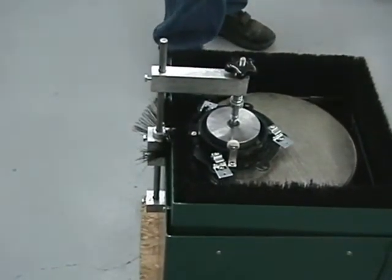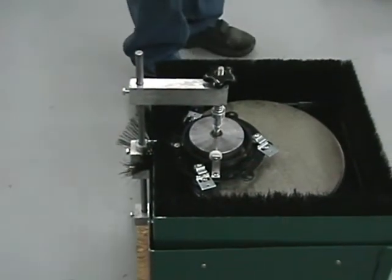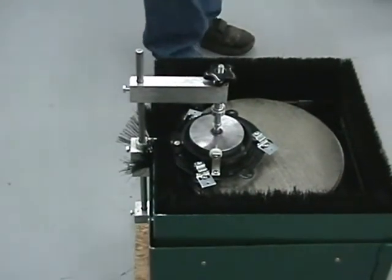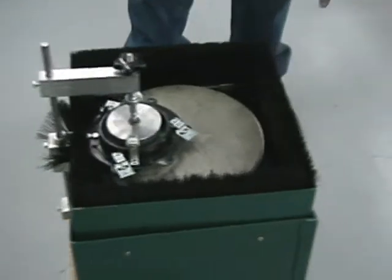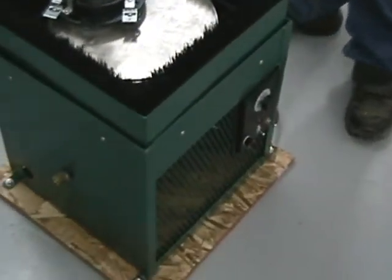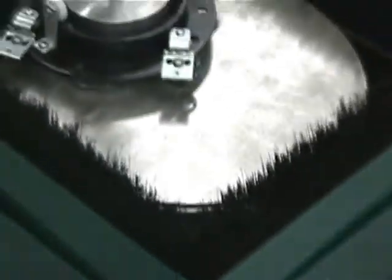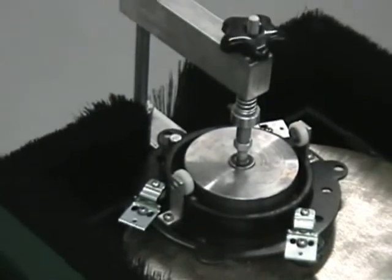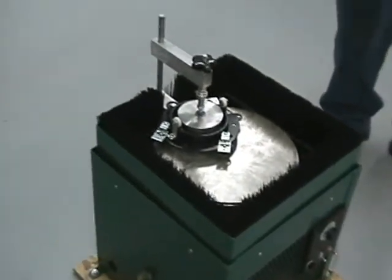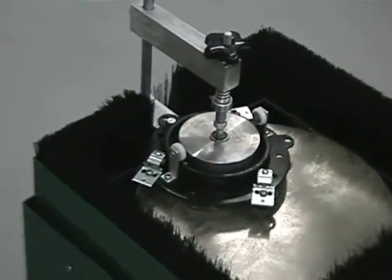It's from rough grind all the way to polish. For lapping pieces, you can walk away and put it in there and let it lap for 5-10 minutes, whatever you want to time it at. And you have a variable speed control unit here in the front, and once you get it in there, you start from zero and you put wherever you feel comfortable grinding it. And then you take it off. We recommend 5 steps all the way from rough grind to polish on this lap.